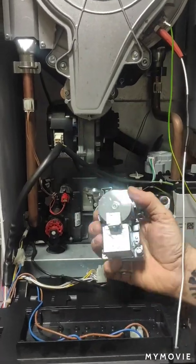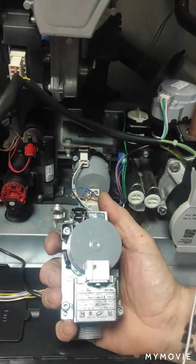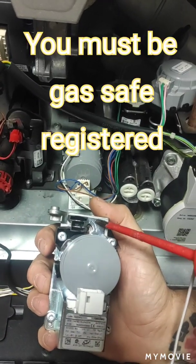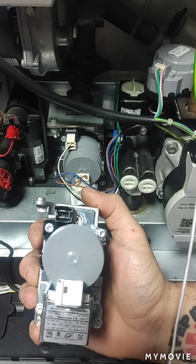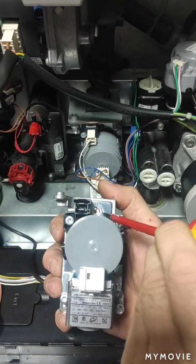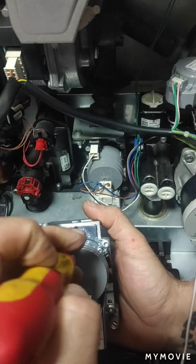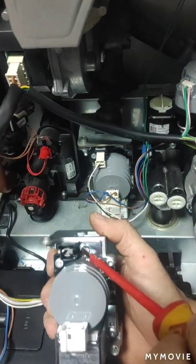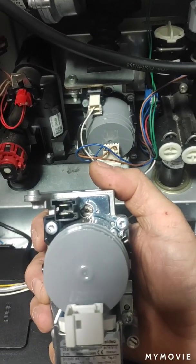For the sake of the video, this is actually a natural gas boiler so I don't really want to set it up for LPG. If it's on number one — north or south — that means it's natural gas. Number two is LPG. I'm going to get my screwdriver and move this screw to east and west. That's the first thing you have to do on the actual boiler.